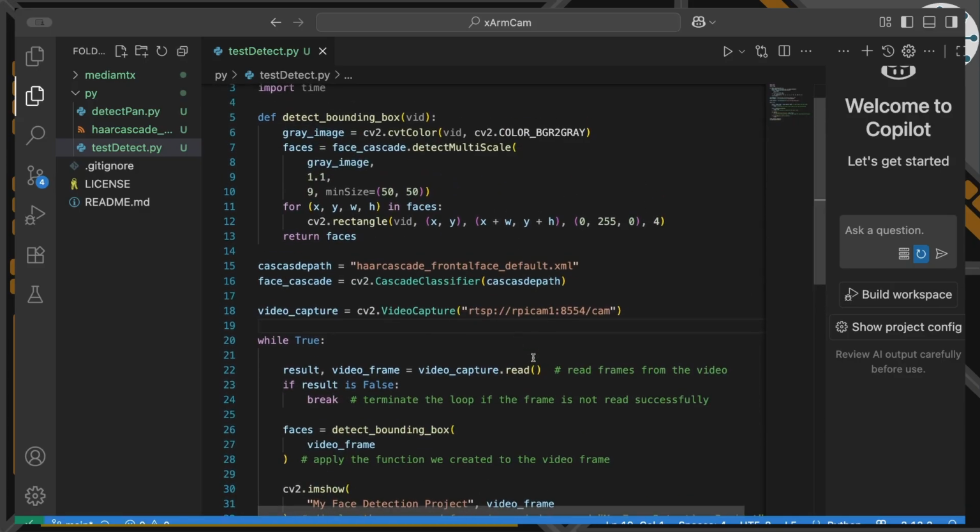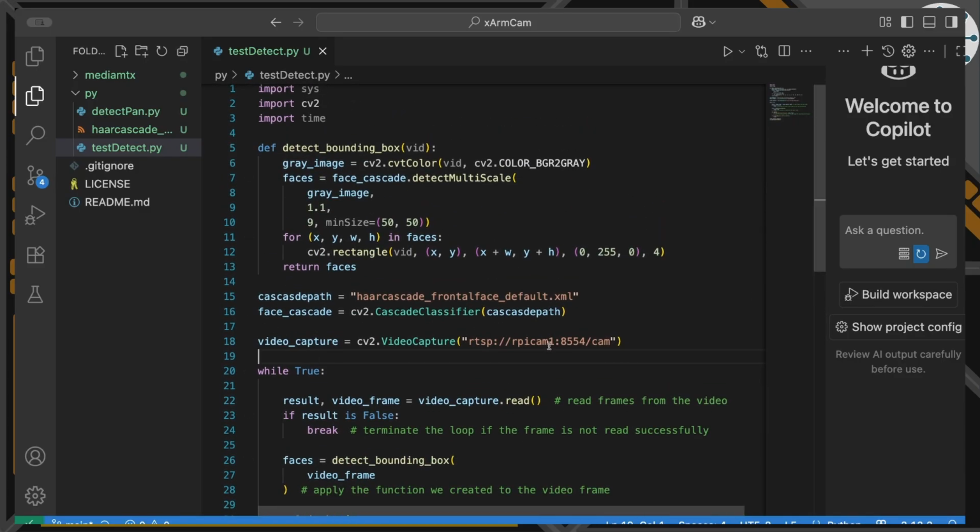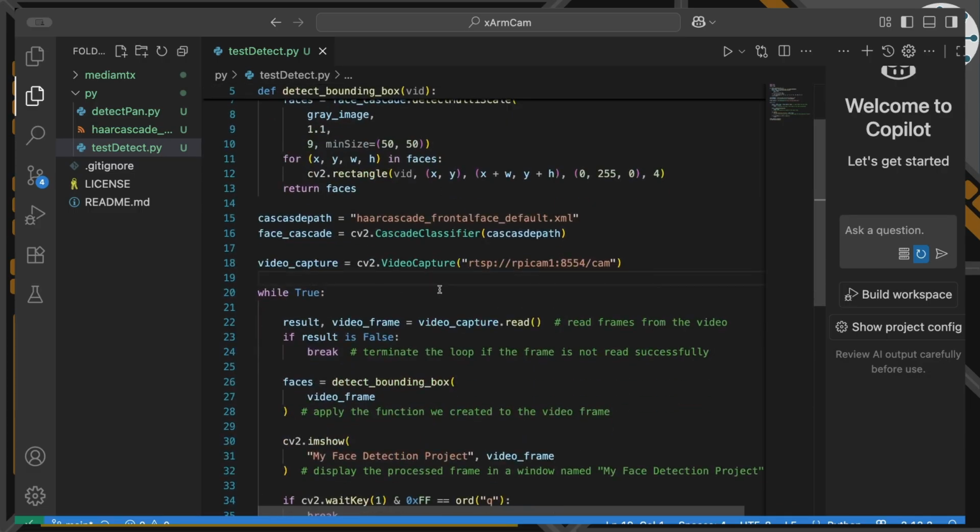So what we're going to do is set up CV2, our OpenCV library, and give it a capture source, which is going to be a URL, not a local video. In fact, I'm going to run this on my Mac so I can actually see the output and record the output for you. But actually that's the same URL that we use to display the video. Well, actually it's not. I switched this to using RTSP. So actually slightly different URL to what we used earlier to get the video out. This is also provided by our media server, so that we can have a slightly different format, RTSP, in order that we can capture that straight into OpenCV2.